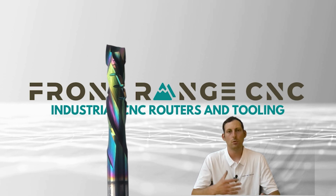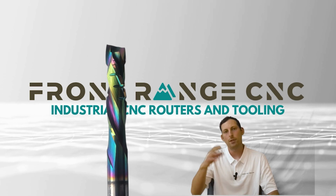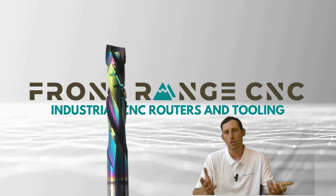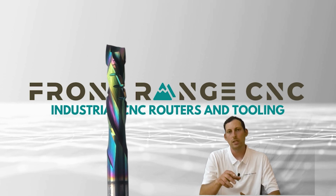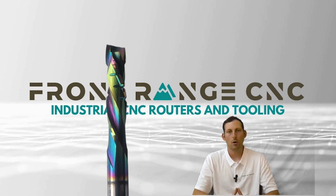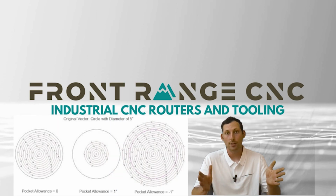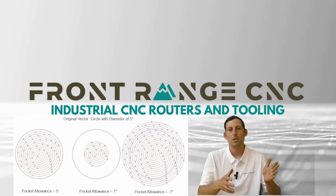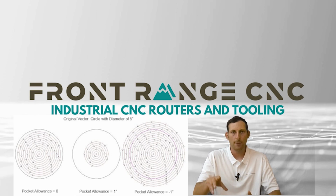And so if you are running a lot of production and it's a hardwood material that you've got to be really aggressive in, a really good strategy is to use a roughing bit to hog out all your material and then swap, get what would be called a finishing bit, or really just a non-roughing bit, and do a final pass. And maybe you leave a little bit of an allowance. So if you want the square to be 10 inches wide, you would actually do the roughing pattern at 9.8, for instance. And then when you get your finishing bit, you're now just going to kiss the corners of your square ever so slightly. And that will basically leave you a nice finish.